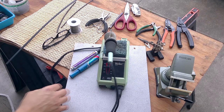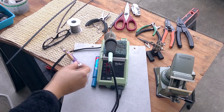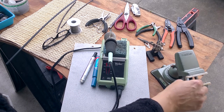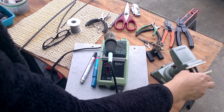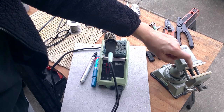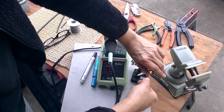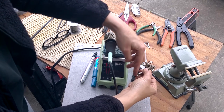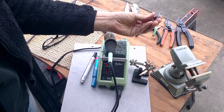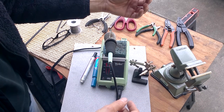I also have a little marker for labeling which wires go to which channel, some flux that I'm not using as much as expected, a little swivel vise with plastic jaws that won't crush anything, and one of those little third-hand things — I hate these because the toothed jaws sink into whatever you're trying to solder. I've got an old-fashioned aluminum heat sink you can clamp onto a wire to keep heat from traveling up and activating heat-shrink tubing. And I've got two pairs of wire strippers.